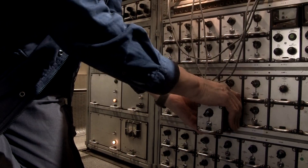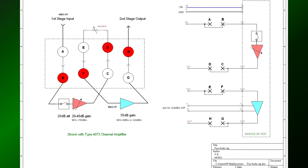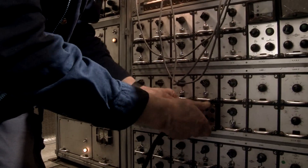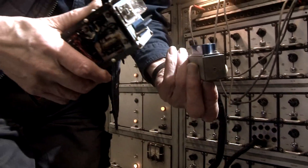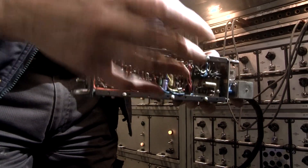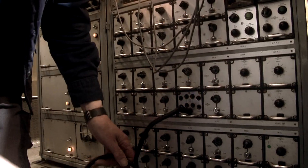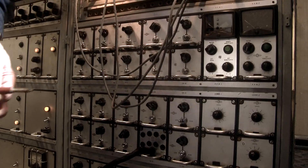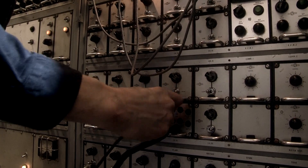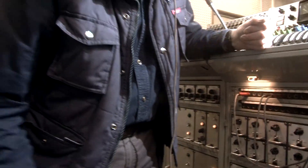So we're pulling amplifier 19 out and putting it down. This is the extender — it has jacks on the front so that we can monitor each circuit. That goes in place of the amplifier, and the amplifier plugs onto the cord so we can utilize it here on the bench. We listened with headphones at various points in the chain to determine just where the signal is and isn't, and that way we can pinpoint the area to look at.